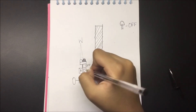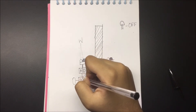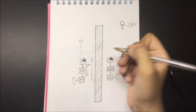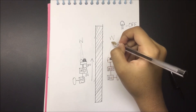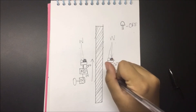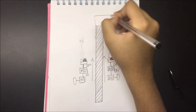Since the surface is white and everything reflects, the wheels are going to be off. The motor driver takes the off signal and converts it into on, then sends a message to the motor asking the wheels to run, and therefore the wheels move forward. The same logic applies to the other wheel — surface is white, reflects, off, motor driver converts to on, wheels move forward. Both wheels are now moving forward, so the line follow robot is working.